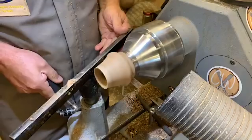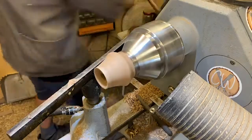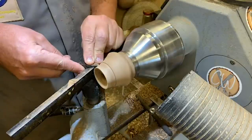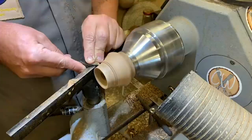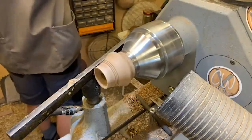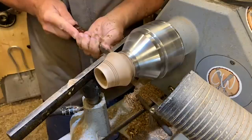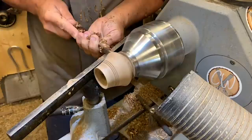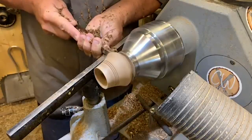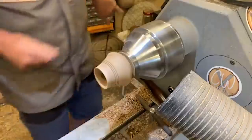On this one, let's put some little lines in — I'll do them quite deep, so I'll do them before sanding. Using my really pointed skew, nice and gentle. A little passing cut where I'm going to take this off to as well. Right, now we sand — same process, back through the grades from 100 to 150, 240, 400.